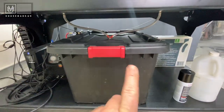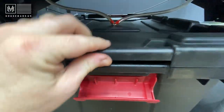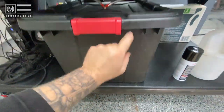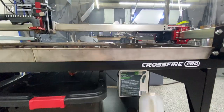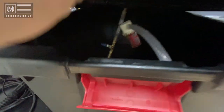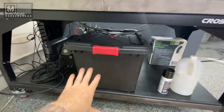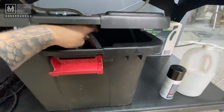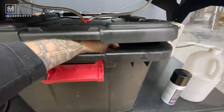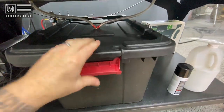I also set up this water bin here. It's got a little fountain pump in it and some valves and a filter in there. What it does is it pumps the water that's in this bin up through the drain holes, and then when I'm done filling it, I just turn these two valves here and it keeps it from draining. When I'm done with the table, I open those two valves and the one ball valve down there with a blue handle, and it drains back down into the bin. There's just enough water in here to fill the table, and the system works pretty good.